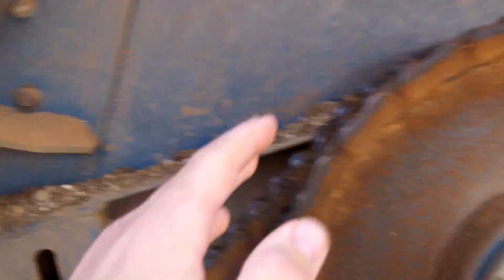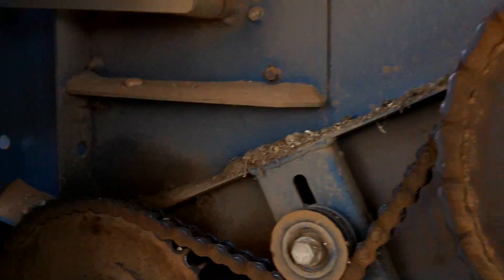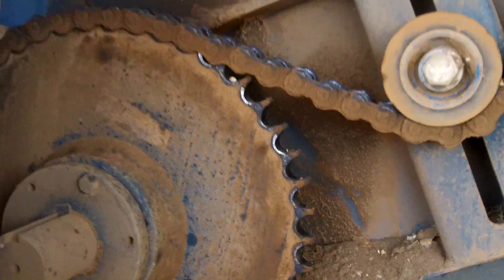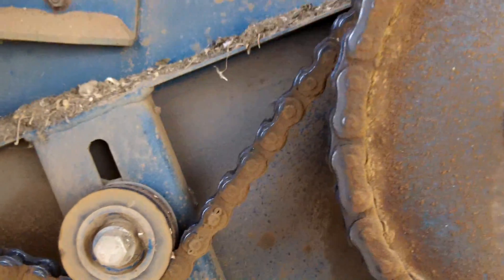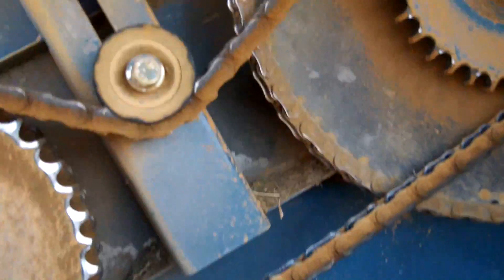Here's the drum, here's another, here's another, here's another, and here's another. The peanut stays at the bottom of the area as it's thrashed by the thrasher, and the plant works its way up and is eventually blown out the back.